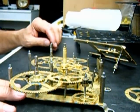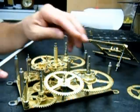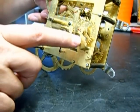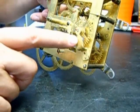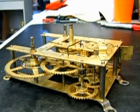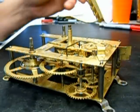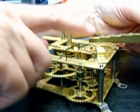I had gone through the ultrasonic and I hand dried it. I put all the wheels back in their places. What we're going to do next is to put the plates back together without the levers to test for worn bushings. No springs in the great wheels — the escape wheel cock holds that bushing in place and also strengthens this area when you push the bushing in. You don't want to be bending this up — there's a special tool for that. Here's the tool: it's just a stepped piece of brass with holes in it. The steps are unequal left and right, so you can slide it in when the escape wheel is out and give a solid surface to the escape wheel cock.